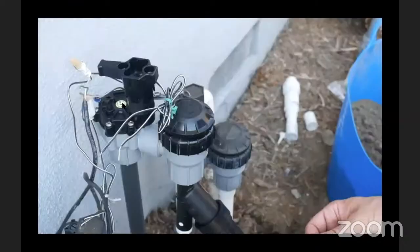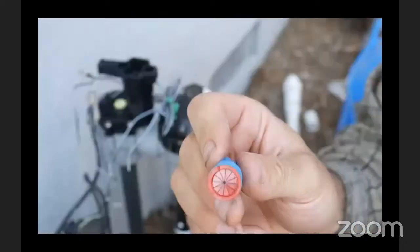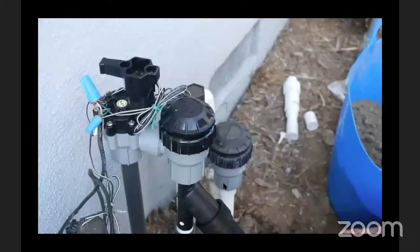And then at the top, you would then wire in that new valve. There were inside rated wire nuts, which often you do see, meant for doing electric work inside the house, but not to be outside. And so you want to replace those with ones that are meant for outside, which have a little bit of a gel to keep the elements off of the wires. And there we go.